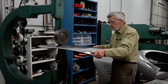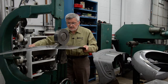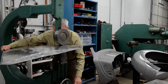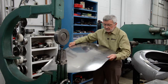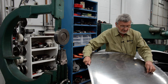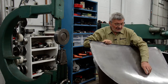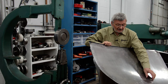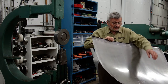Then I try to make almost a 180-degree turn to cover the full 360-degree surface. I turn the panel and loosen up. You can tell this is almost a full circle from the roller. On the inside there are lines, but not really deep. The lines are to hold the metal from spreading — when you push it, the crown helps to keep the metal in and shrink better.